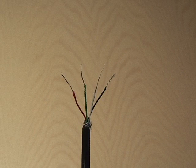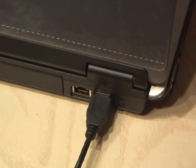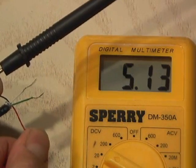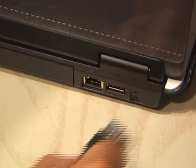Red, green, white, and black. With your computer on, go ahead and plug the USB cable into the USB port, and using a voltmeter, check each of the wires and look for the one that has 5 volts. It's typically going to be the red one, and black will be your ground. After you've checked it, go ahead and unplug the cable from the computer.